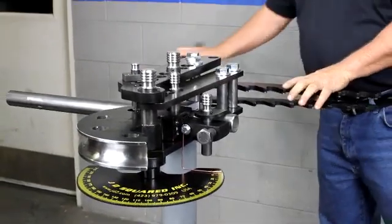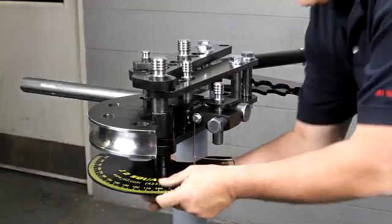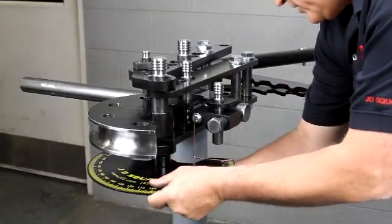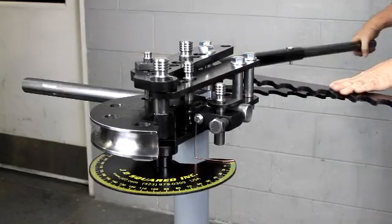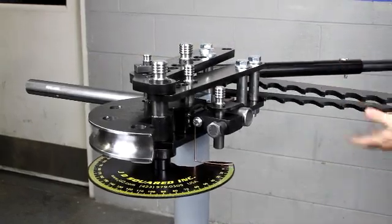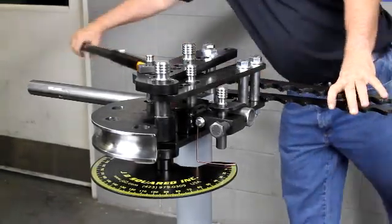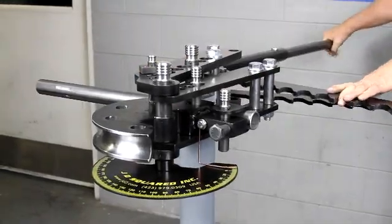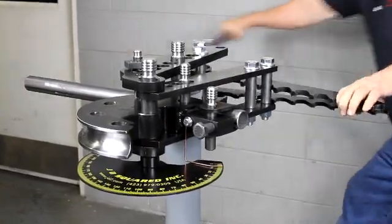Let's take the play out first, then adjust the degree ring. You wouldn't know I've been doing this for 25 years if you're watching. What we're going to do is pull the first ratchet and let the second ratchet engage. I'm putting a little pressure on my thumb — there's nothing automatic about this — just a little pressure and she drops in. And we just keep on going.